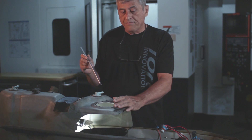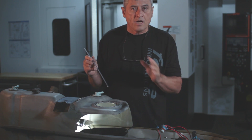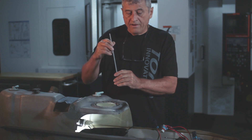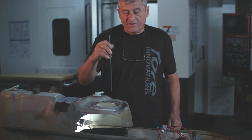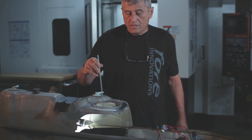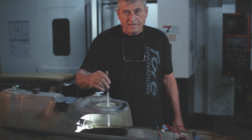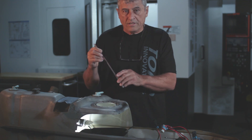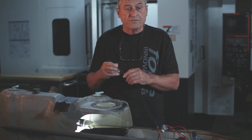Out of five tanks, we found three of them were out of tolerance. For perpendicular measurements to the flange top, you want 11.2 inches on the front, 11.6 inches in the rear, and 11.4 inches on the sides. It is very important that you have these tolerances. If not, you won't be able to make this installation, so you have to get another tank.